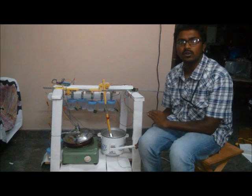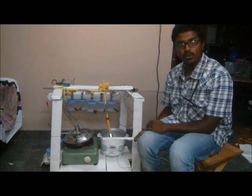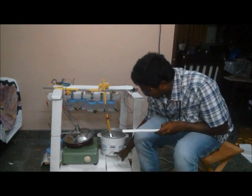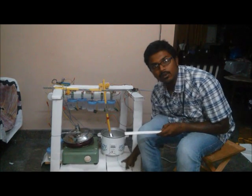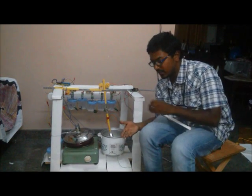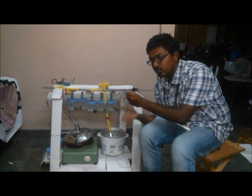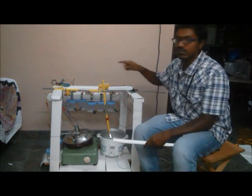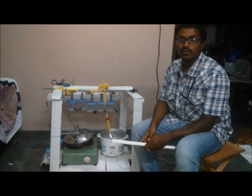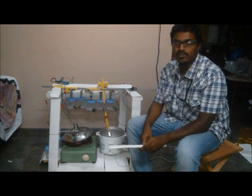When the user wants to start cooking the rice, it goes to warm, and once the rice is cooked, the mechanism goes up. There is a spring used and a 5-volt input is given through an aluminium foil. When the rice is cooked, the spring sticks to the foil, a path is created, and 5 volts is read by the digital read in the microcontroller. Once the microcontroller gets a 5-volt input, it knows to start its automation process.